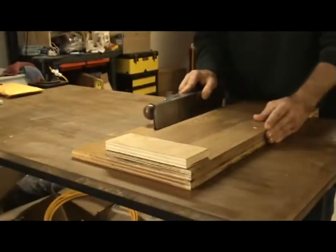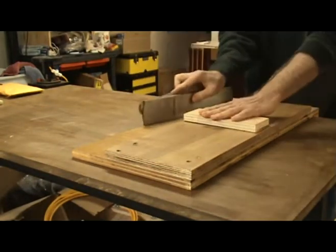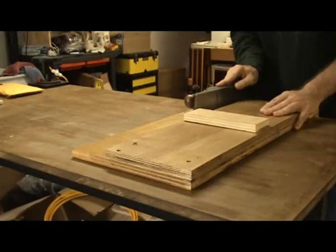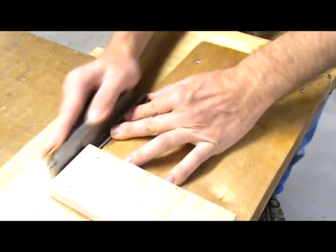It has a block of wood on top of it to help support the workpiece while joining the edge. The block is removable and can be placed closer to the beginning of the board so that you can work on shorter pieces more comfortably.